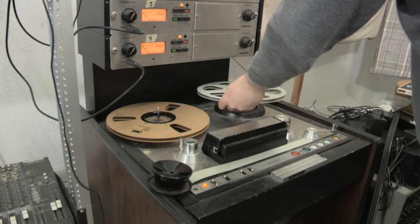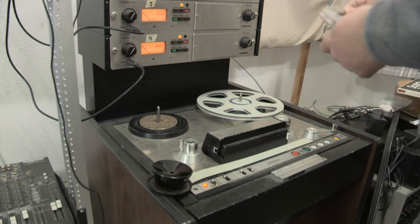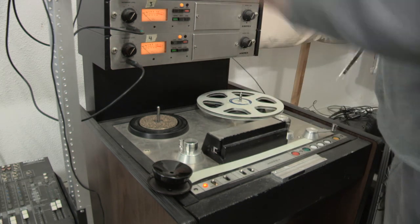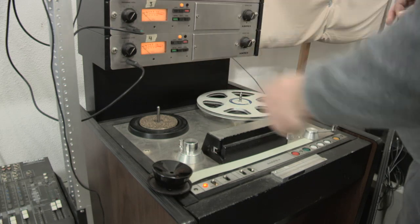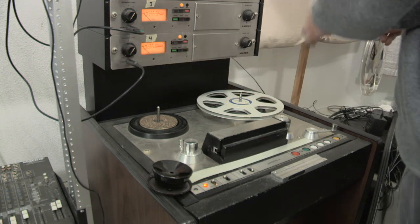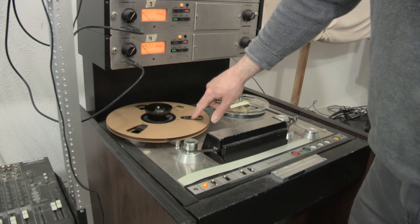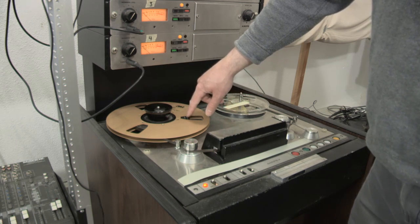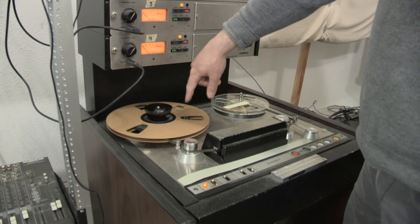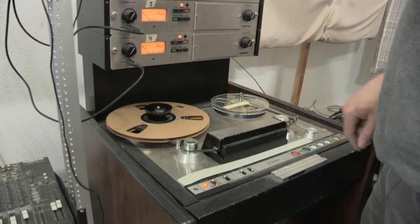The sole reason I keep these cheap plastic tape reels is for doing quick winding projects like this. I'm going to wind the tape from this side to that side, then back over to this one. Then I'll load up the original supply reel on this side to act as the take-up reel, so when it plays to the end at the end of the transfer, it's stored tails out as it should be. You can see there's tape spooled on here, then a little bit of leader, then more tape, then leader, and so on. Some studios used old junker tape as leader in between to mark where the material starts — it's not the best practice. I prefer to just spool on however much leader I need.